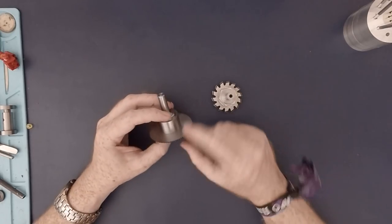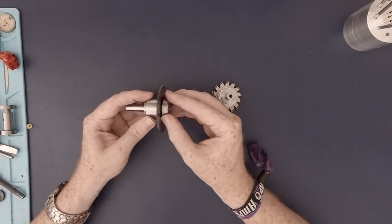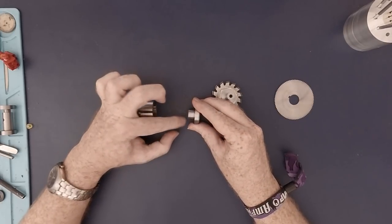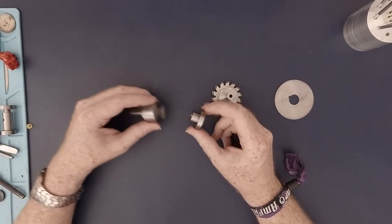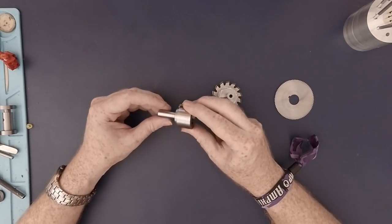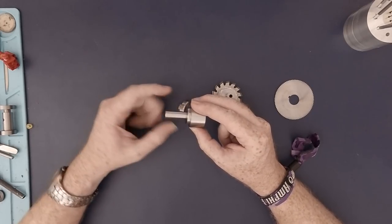The cutter thickness and the cutter inner diameter are different. The design of the slitting saw arbor has the register for the inner diameter of the cutter on the end cap, which in turn registers against the inner bore of the main tool body. In order to make sure that this tool runs true, this inner bore has to be very concentric with the spindle shaft diameter.